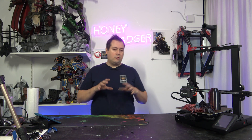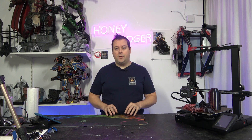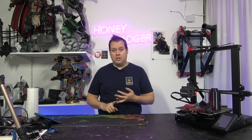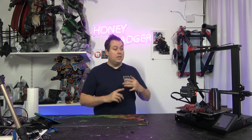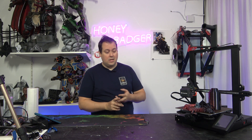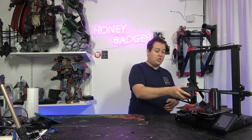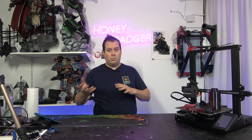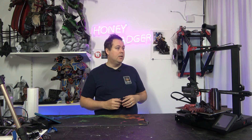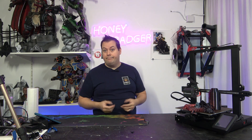The reality is there's a reason why on this channel we generally tell you to get an Ender 3 Pro as your first machine — it's easy to work on, easy to repair, there's not a steep learning curve, and it does what it needs to do. This does what it needs to do, but it isn't easy to repair and it isn't easy to work on. There's no adjustment in the rails because they're linear rails — so if there is any slop where the linear rail moves, tough. You cannot adjust linear rails that way. If you get one and it doesn't have that issue, great. If you get one and it does — nothing you can do.